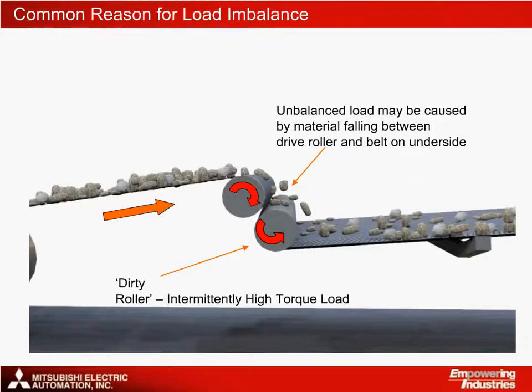If we don't do anything, the motor shaft speed will drop and the conveyor will be stretched on one side and start to bunch up on the other side. As well as putting mechanical stresses on the whole system, this will cause the drive current to fluctuate, which may give us nuisance over current tripping. If another motor is constantly being pulled along, there is a risk that the motor will regenerate into the drive and give us over voltage tripping.